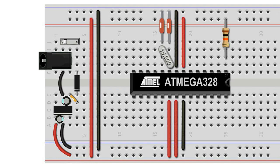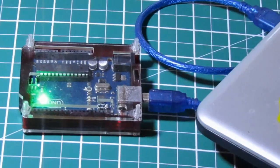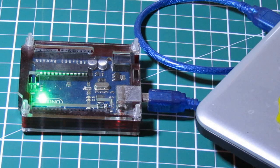Well done, cadets! We've just built what is commonly referred to as a bareduino. For all intents and purposes, this is a very basic, bare-bones Arduino Uno on a breadboard. In this, the second part of our segment, we will program our ATmega chip with the enterprise refit sketch so that it can be used to drive our final circuit board.